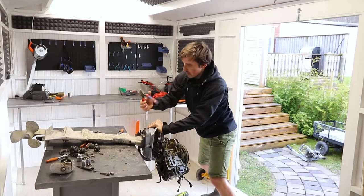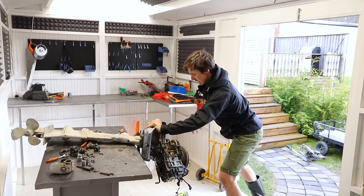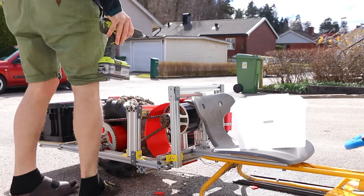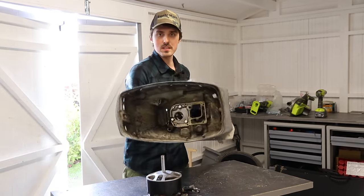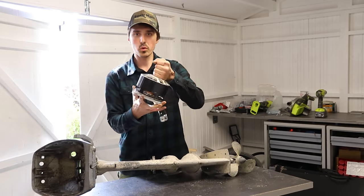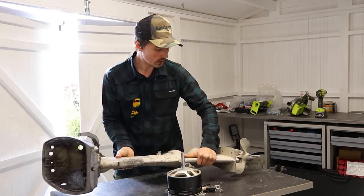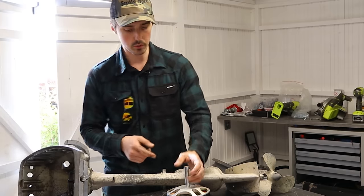All my tools have rust on them so I can't even open the pliers, and yes, this engine was not working — so I'm really saving the planet by reusing this piece of junk. I removed everything; the entire engine compartment is just empty. It's a shaft going down to the propeller, which gave me a lot of confidence. I found out that the shaft has a two-to-one ratio: it takes two revolutions up top to turn the propeller once. I think that's going to fit this motor perfectly.